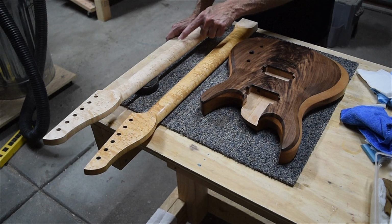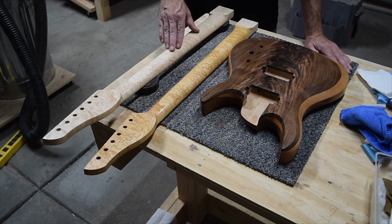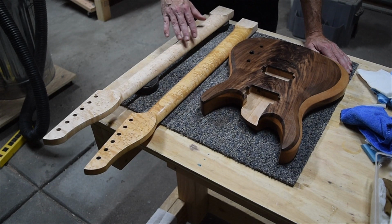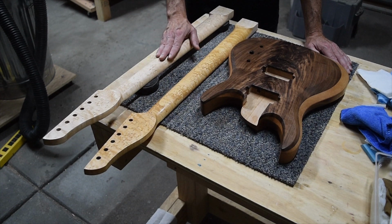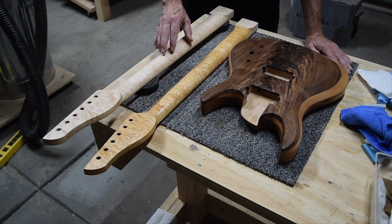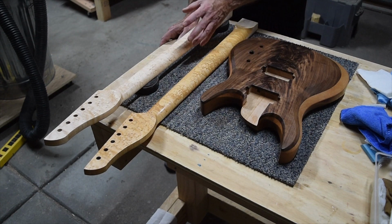If I wanted to make this wood look exactly like it was finished with an oil, I think the best way to do it would be to put down a light, transparent golden amber dye stain to the wood first before applying the Solarez. I could also do the same thing by applying maybe a single coat of an amber shellac before applying the Solarez. But in this effort, I just decided to do Solarez directly over the raw wood.